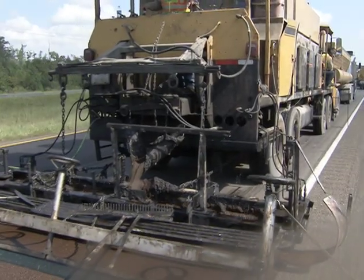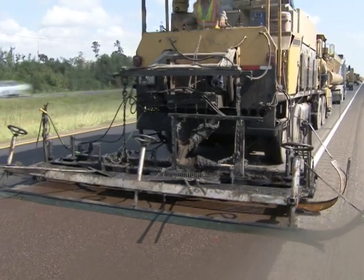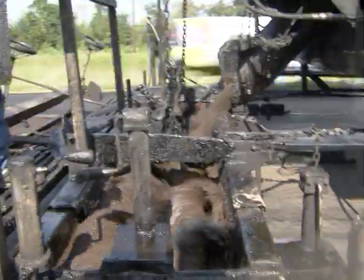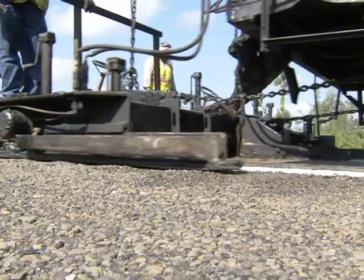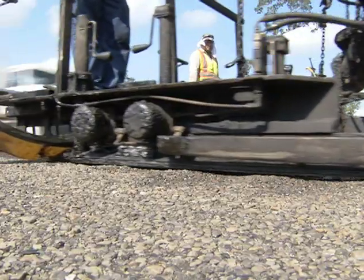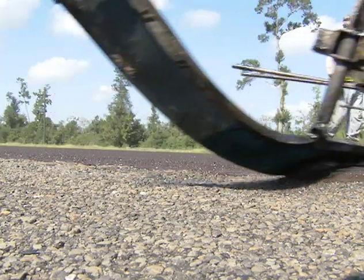In the Lufkin district, we can't afford to use as much hot mix as we would like, so we basically use a lot of micro-surfacing. We use it to cover up slightly rutted flexible pavement and basically restore a ride. From time to time we'll use it for roads that have somewhat of an issue with bleeding seal coats, and sometimes we use it just as a scratch course to fill up ruts in a single lane.